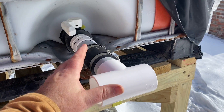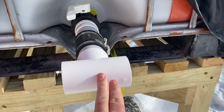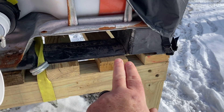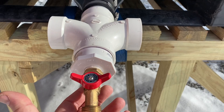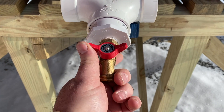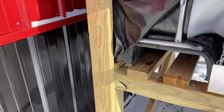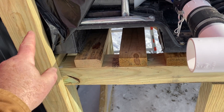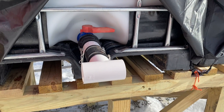On the right side I've got a removable rubber coupler going into a T, and the reason I have a T is I'm going to put a cleanout drain on the end so I can flush this whole piping system, or if I want to add additional tanks someday I can make a connection there. In the center I've got a cross connection with a threaded insert and a garden hose connector — this is where I'll hook up the garden hose or the booster pump. On the left side, right up against the barn, there's another T where my overflow is going to come out. Now we've got to cut pipes to go between the three tanks.